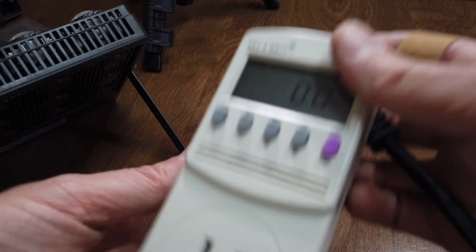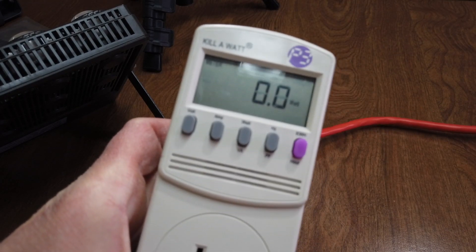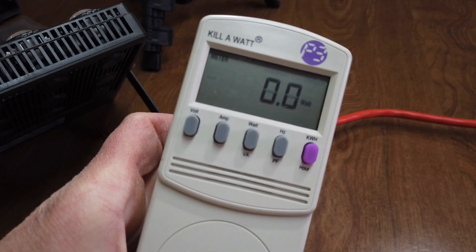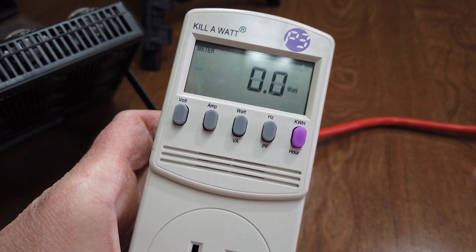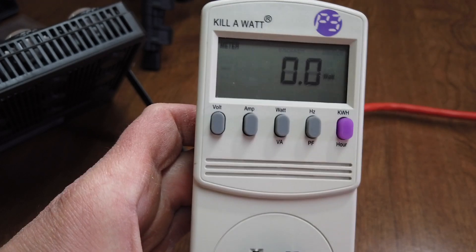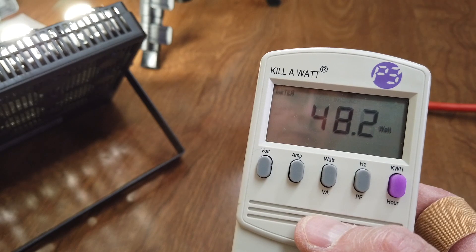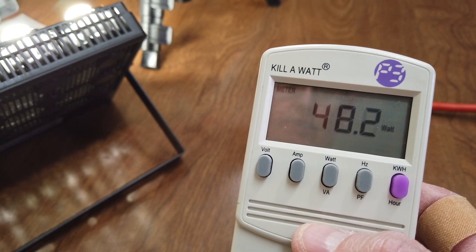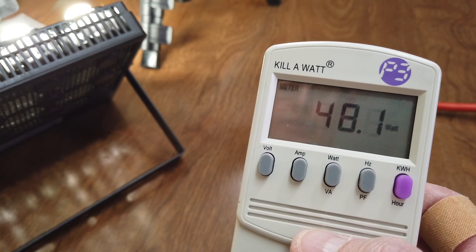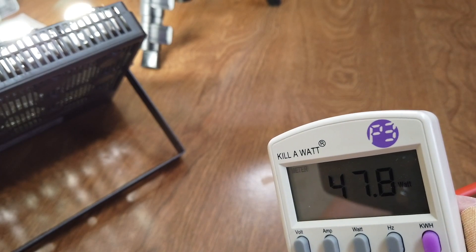Let's go ahead and plug it up. I've got a kill-a-watt tester here. Most of the Sansi lights, except the lower wattage ones, come in a little under the advertised wattage — that's not a big deal. I'm expecting it to be a little less than 70 watts. It's reading around 48 watts, fluctuating between 47 and 48, so just a hair under 50 watts actual — which is more than the 50 watt floodlight that was actually around 39 watts.